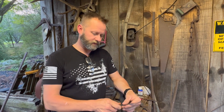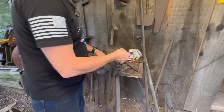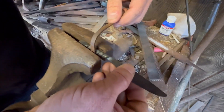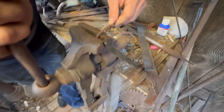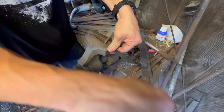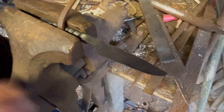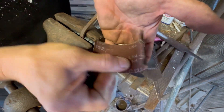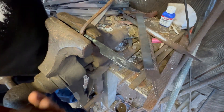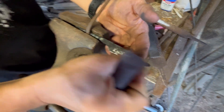All right, I'm going to get it viced up. Like I said, it's not been touched yet and of course it's not been hardened — I ain't even stamped it yet. So I'm going to get it in the vise, get it as flat as I can. I'm just using this little piece of steel here to make it fit the vise because that little curly Q handle right there, that vise ain't wanting to bite it. I have to use that as a filler. Now, sometimes when you're doing this and it's still got the scale from the forge on it, I'll take a little piece of sandpaper and just knock some of that off, or my file will start skating because that old carbon or scale buildup on there — it'll cause even a sharp file to just skate on the metal and not start cutting in.